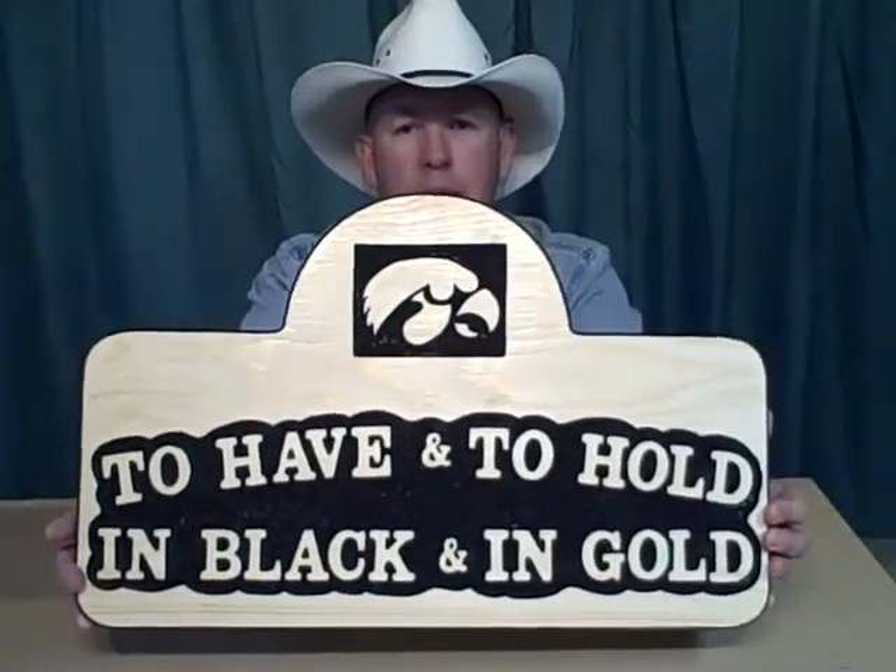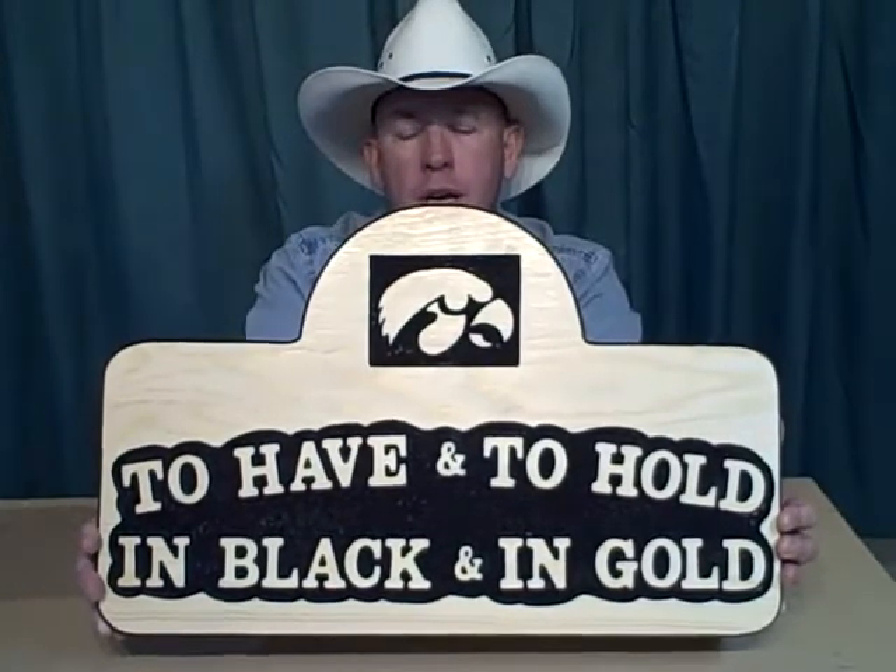Here's another sign that I made with that laminated board. If you've got anything that's wider than a one by six, I highly recommend using this stuff. It makes a real nice sign. One thing you do have to watch out for when using this stuff is sometimes you'll get a little bit of cupping. Just pay attention when you pick up the boards that they're not cupped too much — a little bit you can get away with, but you don't want it cupped very much. And then watch for knots and that kind of stuff, but it really makes nice looking signs.